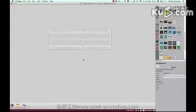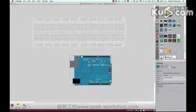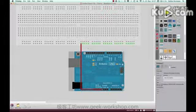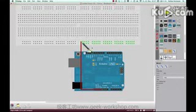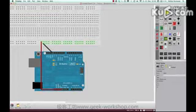So, and how does this look in Fritzing? So let's build it here. At first I will connect the power source. So here it is a 5V plus. Let's make it red, and actually I would like to have this plus here, and let's make a ground connection there. So we have a servo motor here.